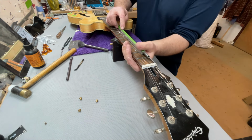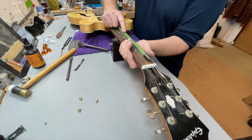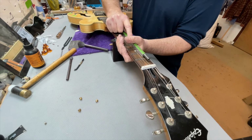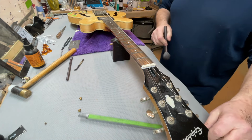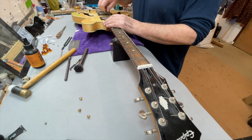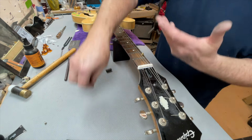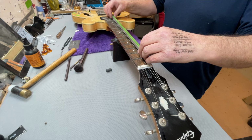So yeah, that was my newer definition, or my newer assessment, of why most guitars need some fret work. As I say, not because of the carelessness of the fretting, but because of the idiosyncratic behaviour of the wood in the neck and the fingerboard under load. And I think when I first started, I would have imagined that might account for, I don't know, maximum 10% accuracy difference between this method, doing it the way I'm doing it now, and the old-fashioned neck strings off, neck flat method, using a fret rocker.